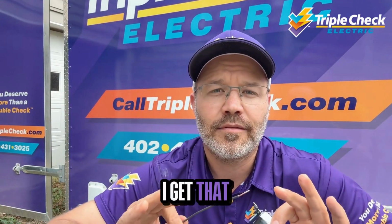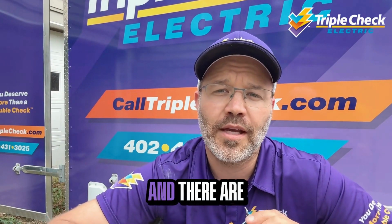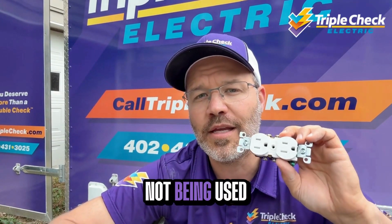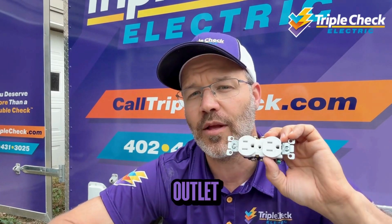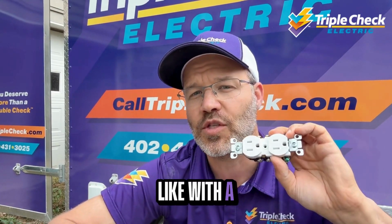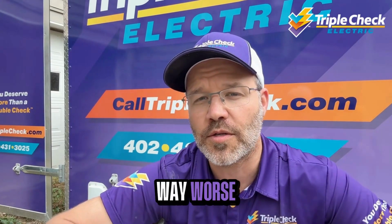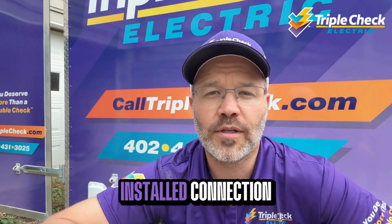I get that they're installed in 99% of homes and there are no issues. The thing is with these, most outlets are not being used. But when you start using an outlet and you start pumping amperage through it, like with the space heater, this backstab method is going to make issues way worse than if you have a properly installed connection.